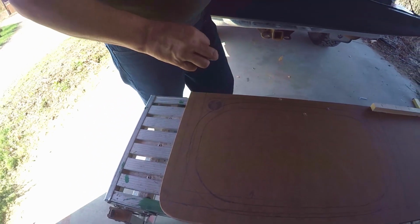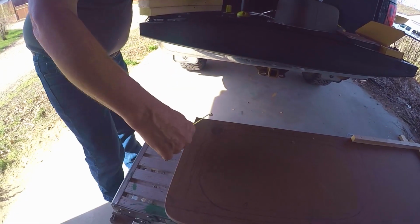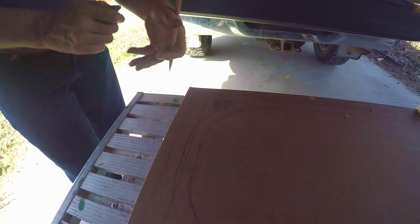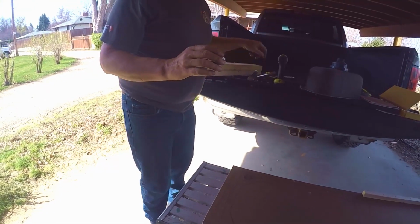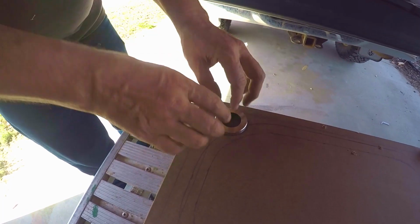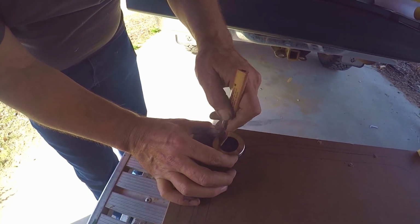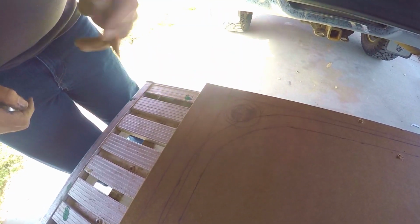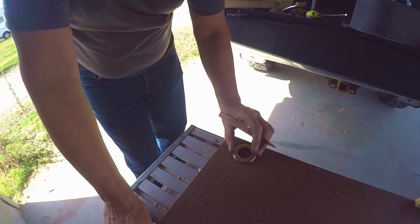Now we got to work on our faucet. 30.5, 1 3/4. Now once we set this faucet on there, hopefully it looks right. So here this is the trim piece. If we set that right like that, if we look down, we'll see here is the center. And I mean, that's real close. We pull back out, we can see that our circle right here is right at the edge of the lip. So that's indicating that it looks like we did a good job on our measurements, because that's how we want it. We're going to have this sit just on top of the lip.